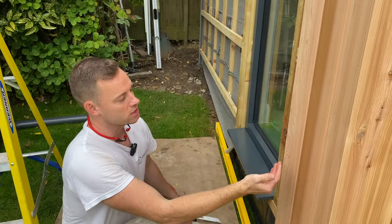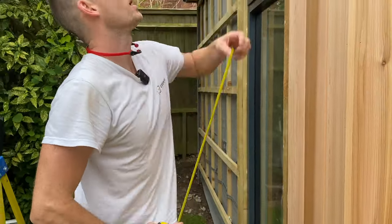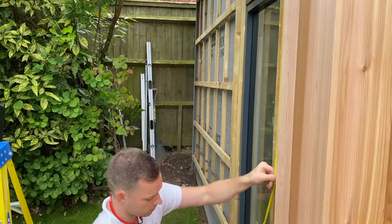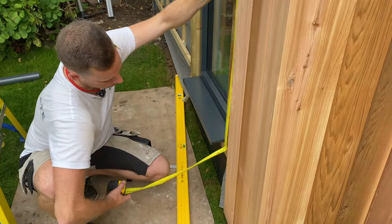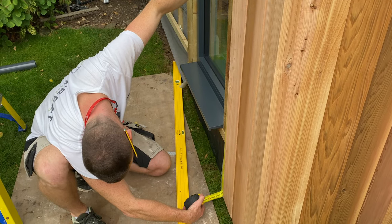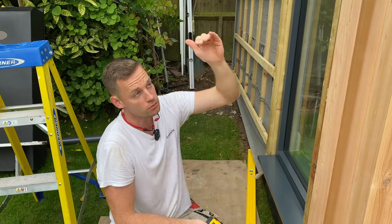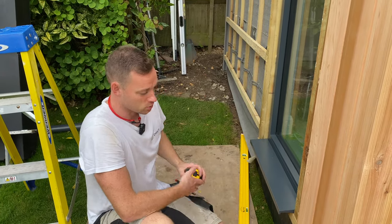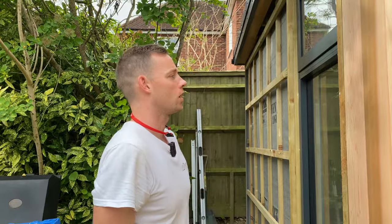Because the roof is coming down and the floor is coming up, you'll need to measure every board individually. Stick your tape up, run it down from the top, move your level all the way to the bottom — that gives you your measurement, say 2516mm. Start your cut with the roof angle, measure from the back of the board to the other end, and you just work up. That's the best and quickest way to do it.